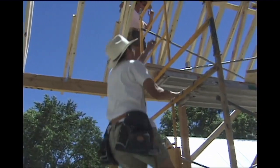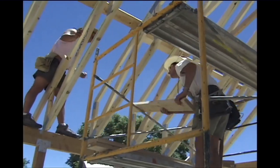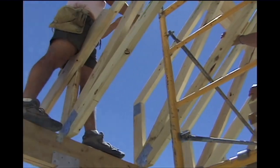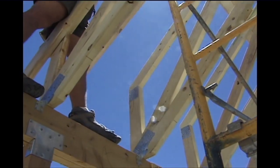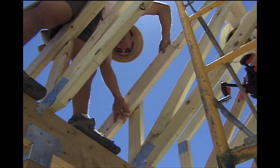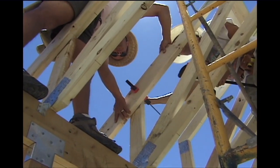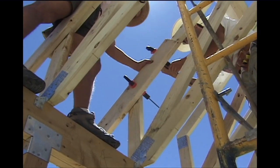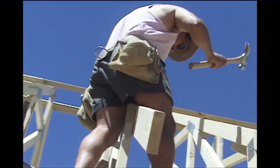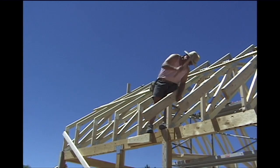The pre-assembled trusses do not include the roof overhang for the control of solar gain. So we attach a 2x6 rafter tail directly to the truss. This saved a considerable amount of wood since the upper member of the truss can be constructed out of 2x4s instead of 2x6s. The 2x6 was used mainly for aesthetic reasons — it just looked better than a 2x4, and we were able to obtain the look without overbuilding the entire pre-assembled truss.